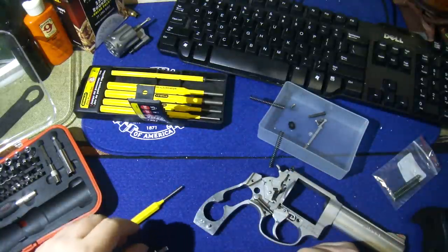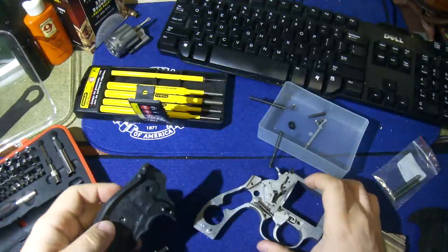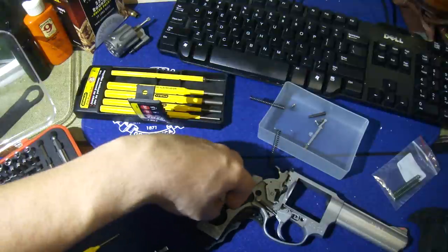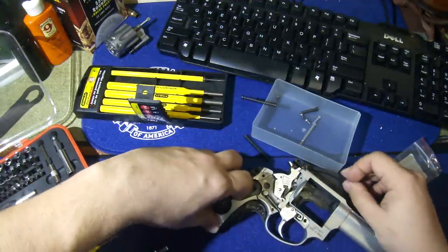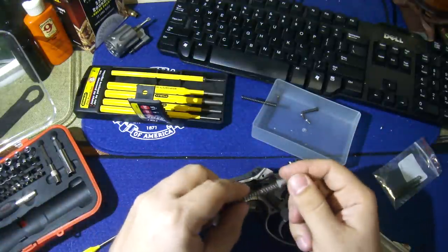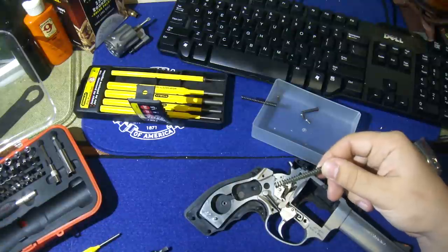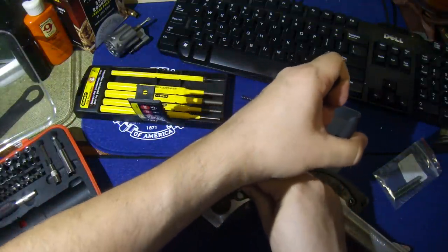It's important when we test the gun's functionality that the spring rests on the lip — you can see the little ball joint lying on that spring where it's hitting that lip. Now we're going to put back on the new mainspring. It's a good idea to have things nicely greased in here for functionality. One of the problems with this Taurus when we got it was a lot of dried caked Cosmoline — I think this was new old stock, so it had to have a proper cleaning. This actually helps if you put the reverse grip on, because it'll hold the plate a bit as you try to line things up. Now, this main spring guide rod — you want it so that the little hump sticks out towards the rear of the revolver. If it's pointing down it's going to ride against the little tiny housing for the other spring and your gun won't be fully able to cock itself.